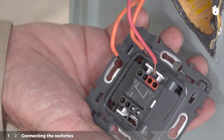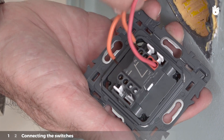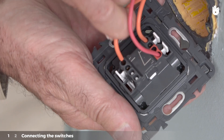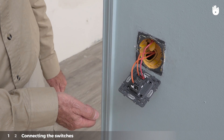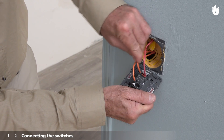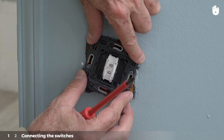Place the end of the red phase wire in the red terminal of the switch, indicated by the letter L. Place the ends of the other two stripped wires in terminals 1 and 2 of the switch. These are the two conductors that function as carrying wires — they will make the liaison between the two switches. Verify that the wires are attached tightly by pulling on them.